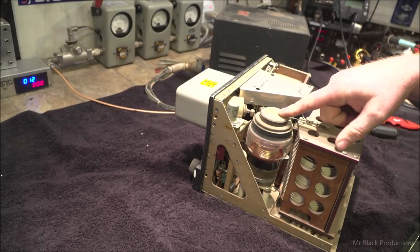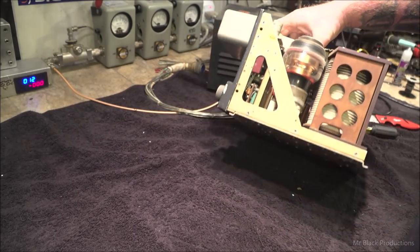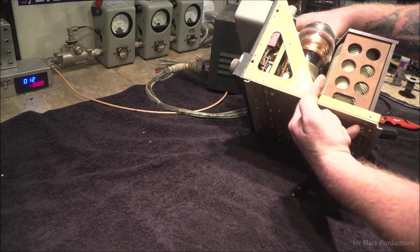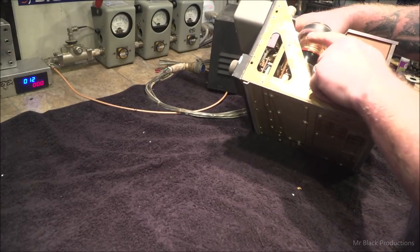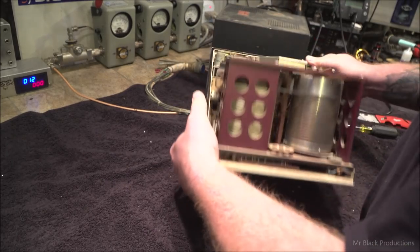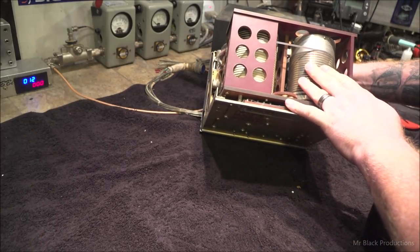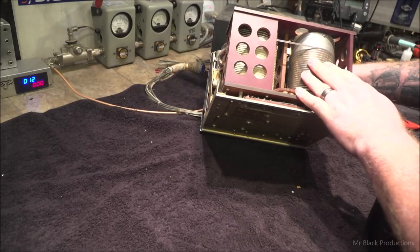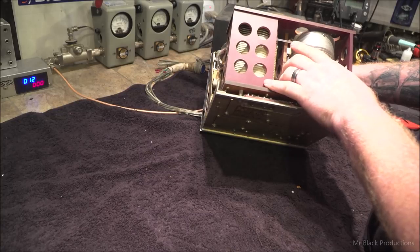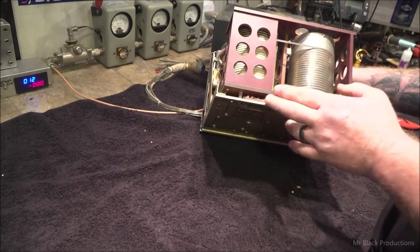Have you seen the price of vacuum caps here lately? Now, this isn't a large, what they call large throw. There's a little tiny wire that runs up the center of this thing and it causes this diaphragm bellows to move. But we bought it for the vacuum cap and the inductive tuners, which this thing is really neat how this works. There's a spindle wheel, okay, and then you have your collector wheel, which is insulated, and then this silver plated copper lead that runs between the two.